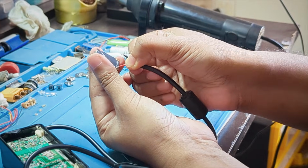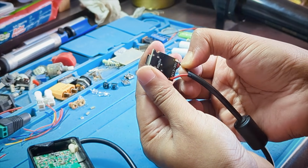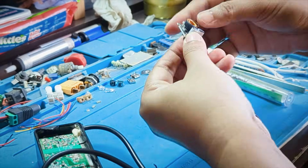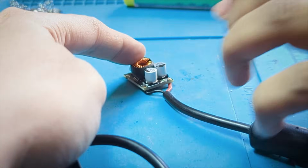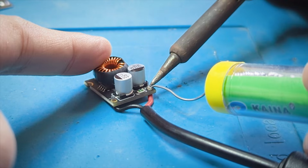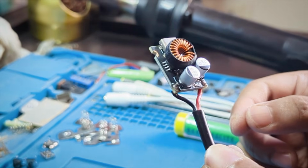Once you're ready, put the wires through the connection holes. Goes without saying, but please make sure to check the polarity. The board should have the plus and minus sign to indicate which wire goes where. Luckily, I have 3 hands to hold the iron, the solder and the board, but most of you may not be so lucky, and you may want to get a 3rd hand off of Amazon. Secure the solder joints, and that's the hardest part of the job done and dusted.